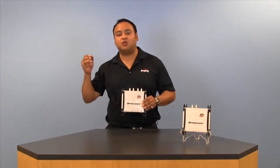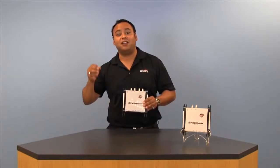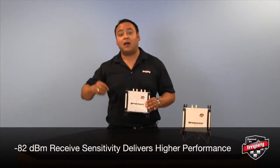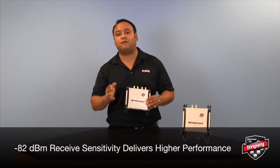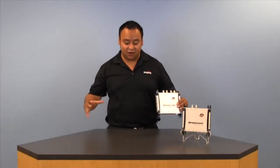The Speedway Revolution delivers up to a full 32.5 dBm of transmit power and delivers an industry-leading receive sensitivity at negative 82 dBm, allowing it to see and read more tags from further distances, as well as read more tags when packed together in a close space.